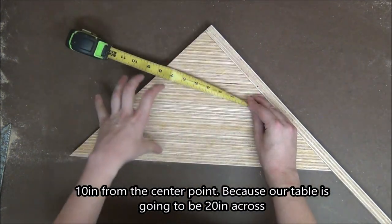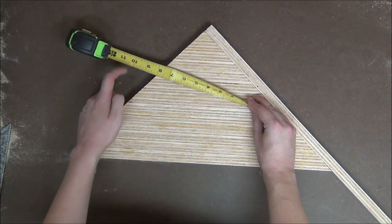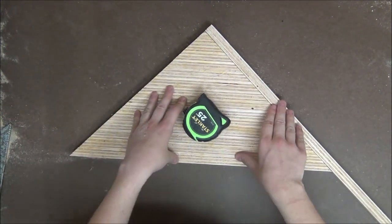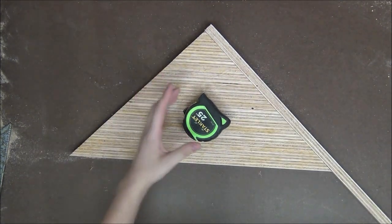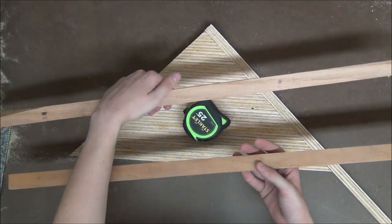Because of how our triangle is set up we only need to add a few boards over here to hit our 10-inch mark, but we're going to need to add quite a few over here to hit it. As long as we keep all that in mind while we build, we'll be able to stretch out our strips a lot longer and greatly minimize any wasted material. So let's go ahead and get started — but don't forget to sprinkle in your oak strips every now and then to add a little bit of flavor.